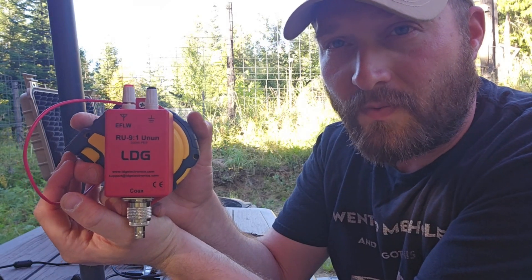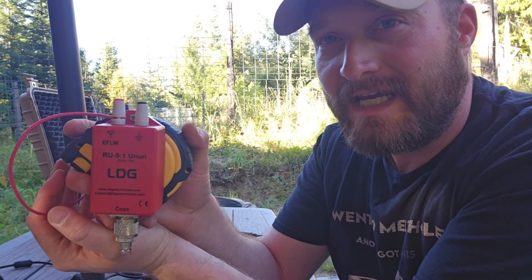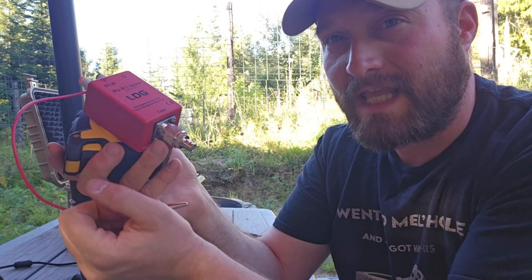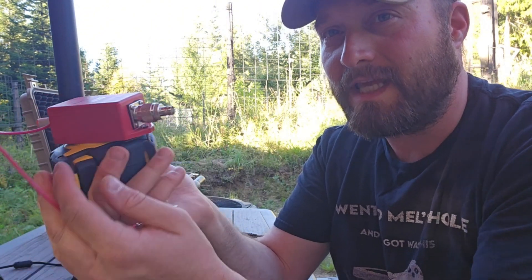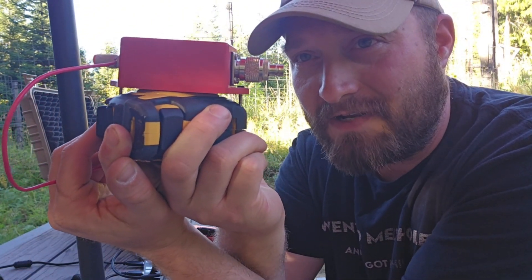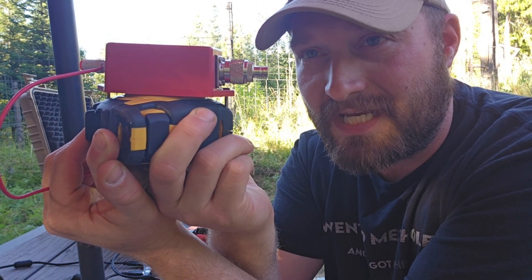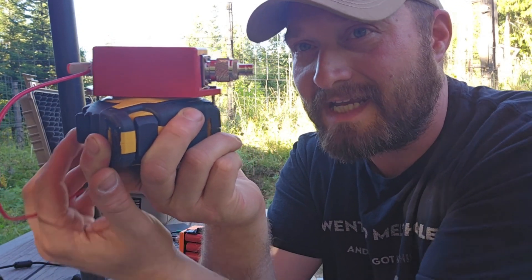Here's the new and improved random tape measure antenna. I did away with that solid core wire that was kind of problematic. I had initially thought it would need to be load-bearing, but then I realized the holes on the un-un meet precisely with the holes on the measuring tape body, so I got some number 6 machine screws and sunk those in there.